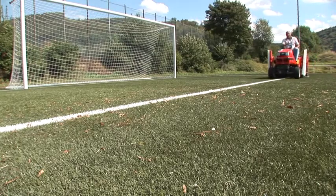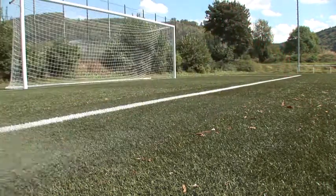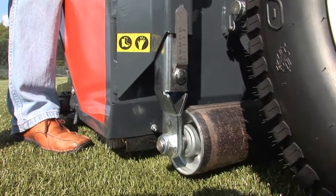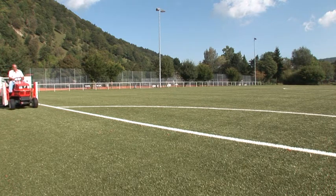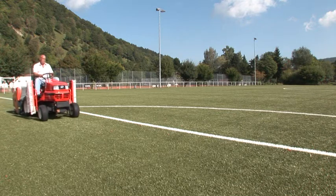On ideal conditions, it is therefore possible to basically clean a typical sized soccer pitch in two hours. The occasional deep cleaning operation, suggested by the turf manufacturers, can be accomplished with the rotary brush being adjusted to a deeper level, as well as the necessary driving speed adjustment to a much slower speed than regular.